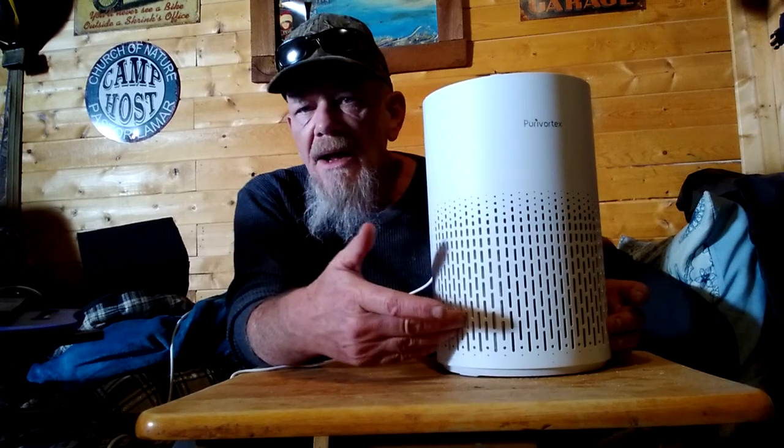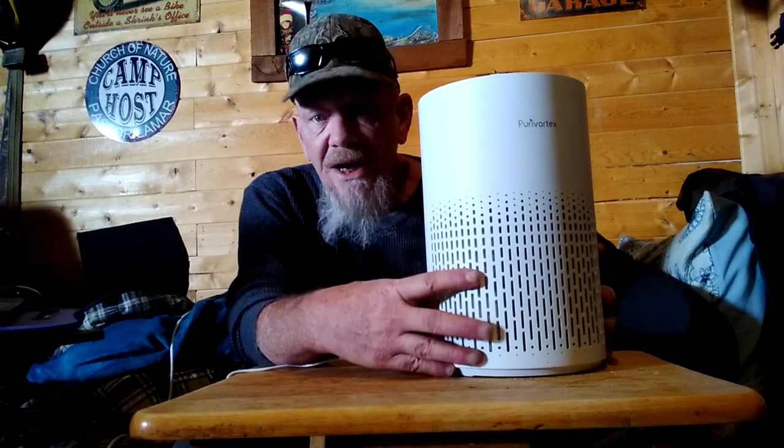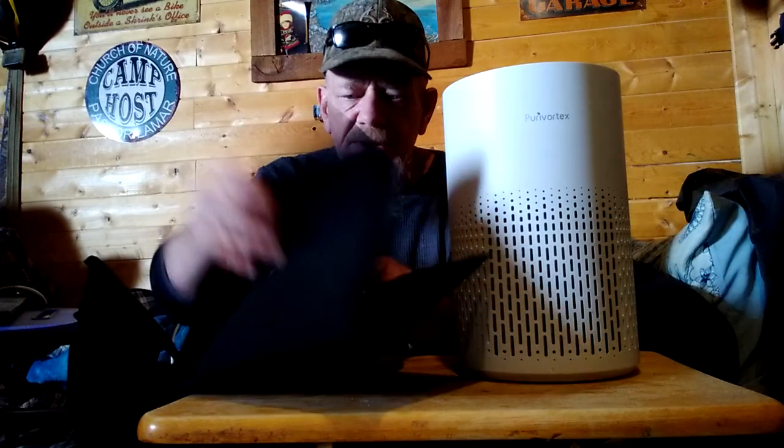Another product you can get to make these filters last even longer — since they have to be replaced about every six months — is a charcoal filter pad that you can get to go on the outside of these. A charcoal pad comes in a sheet of material, 16 by 48 inches. This is a carbon filter. Carbon filters are different than the HEPA filters — they're designed to capture VOCs, which are volatile organic compounds. That's anything you use in your house; even your insulation can produce volatile organic compounds. VOC formaldehyde is one that comes off your insulation. If you've ever smelled new carpet and how strong that smell is, that's a volatile organic compound. Anything like cleaning supplies with a real strong smell, or pesticides that you may spray in your house — those all contain VOCs. This filter protects you from those getting into the air.